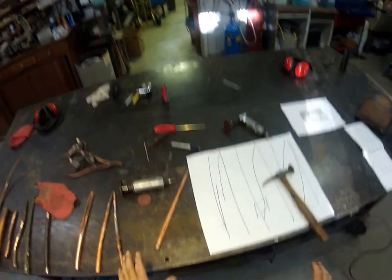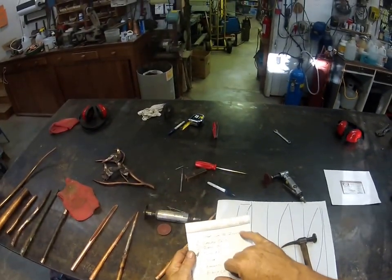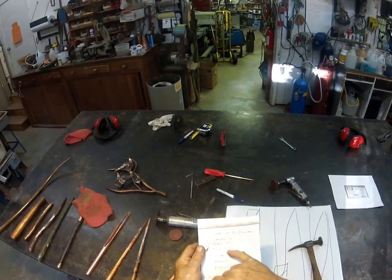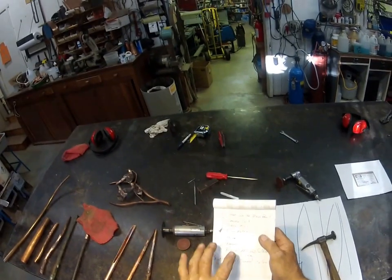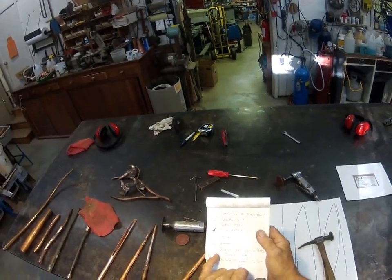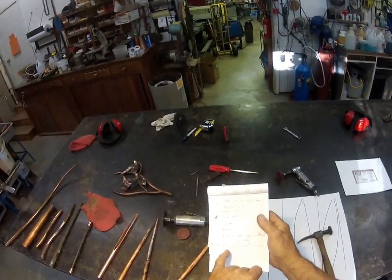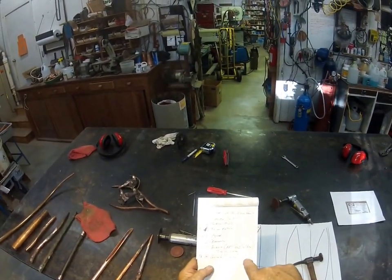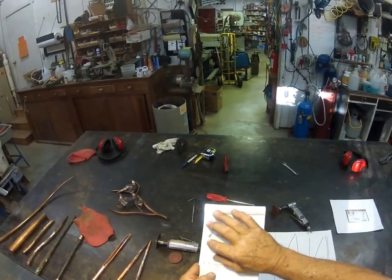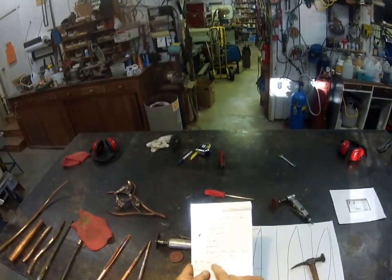So that's the essence of it. Here's my quick step list: Start by cutting it at the zero point. Do a convex cut. Come out of it slowly. Trim the notch. Anneal it — heat it up so that you can bend it and compress it back together nicely. Hammer it. Braze it. Never cold solder — don't use plumber's solder; you have to braze it. TIG is ideal but not necessary. The first seven items are half of your time. Grind, clean, and color is the other half. Don't expect this to go fast — it goes really slow, especially the grinding, cleaning, and coloring.